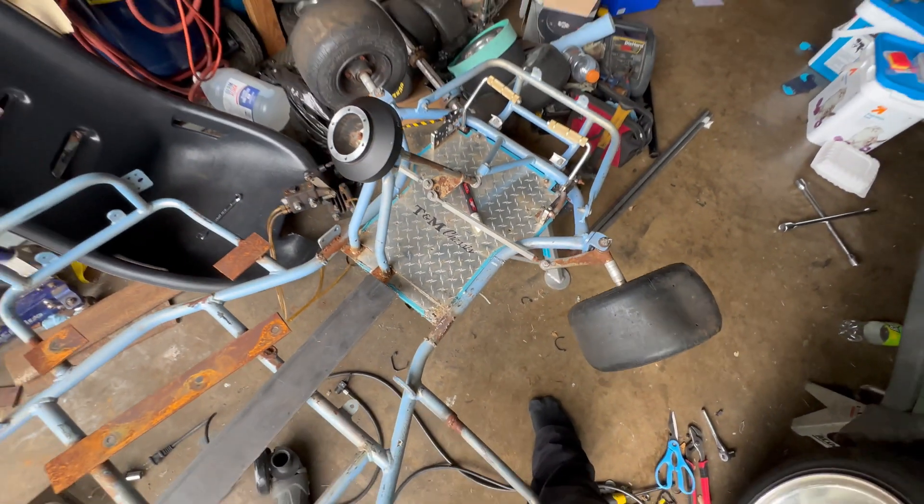The holes are drilled and the bolts are in. These aren't the permanent bolts because they're just sticking out a lot — I bought longer ones expecting to go through an inch tube, but instead I went with this plate idea which is simpler. All I gotta do is get some proper size bolts, stick it on there, and adjust it left and right until it lines up. I used the standard 212cc Predator diagram on my phone and it worked. The engine is mounted. We got power to the wheels finally — engine mounted, bolts in, chain on. The engine is making a lot of noise from the gas tank getting ready, but we have throttle.